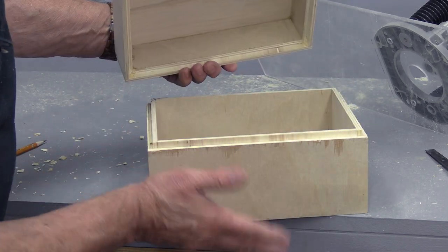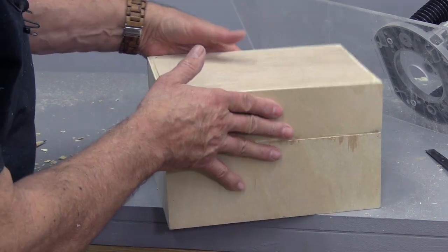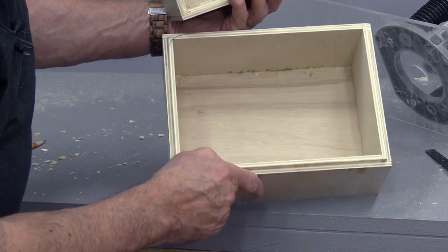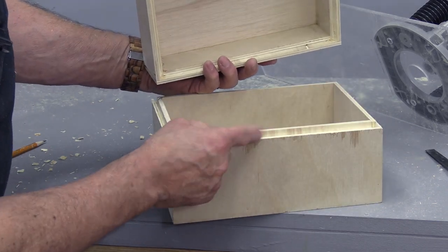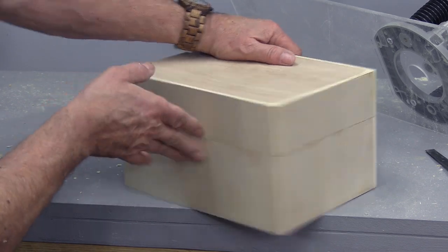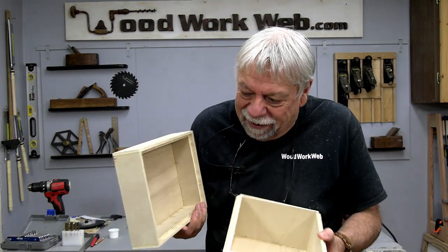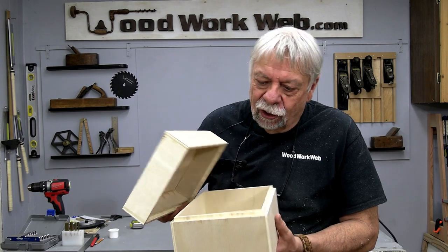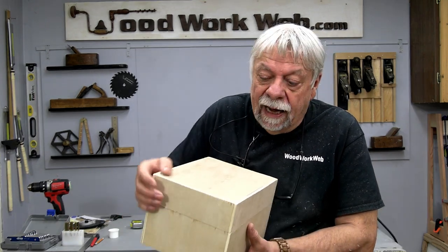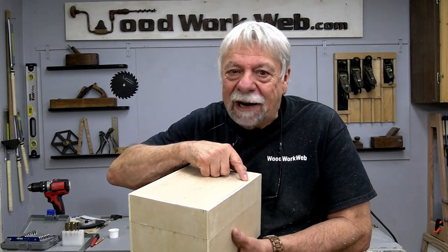That's exactly what I was looking for — a lid we could put on after the fact that would have the lip in there, and it works perfectly. The reason it works is that most plywoods are slightly undersized. This is half-inch but a little bit undersized, and because of that a half-inch setting gives us just enough room to put a lid on like that. That concludes my video and the box for today. I'm really happy with how this turned out — a nice interlocking lid with the special top. Now I know I can do the same thing with natural wood by planing to the right sizes. I'm Colin Kinnett for Woodwork Web, thanks for watching.